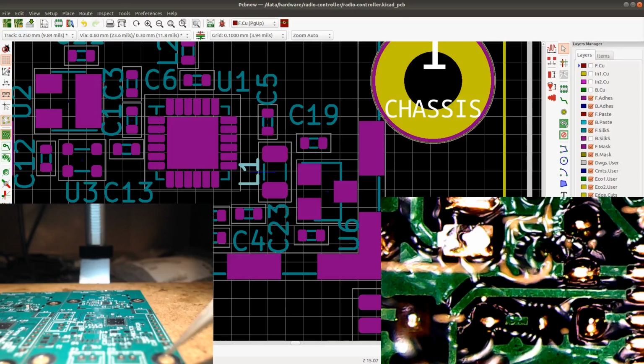What's next on the list? Let's see. Get rid of all the garbage. It's next on the list. And then it's some capacitors, electrolytic ones. I mount them last. Let's see, microprocessors. Could be something, but I think I leave it for later. So I want to mount all the components that are less sensitive to heat first, and then I'm going to mount the microprocessors and the electrolytic capacitors and anything that contains lots of plastic that tends to melt.